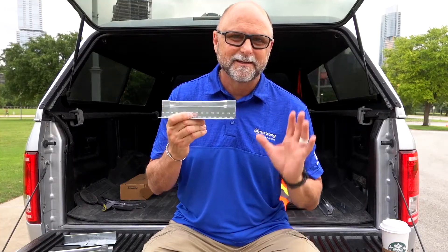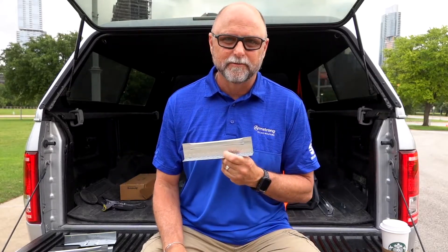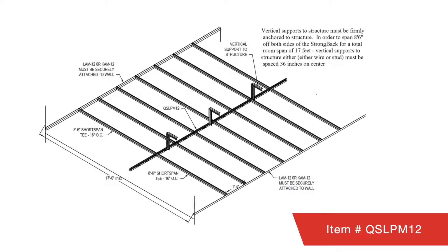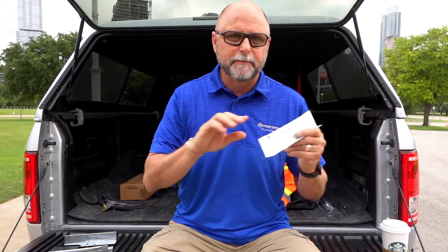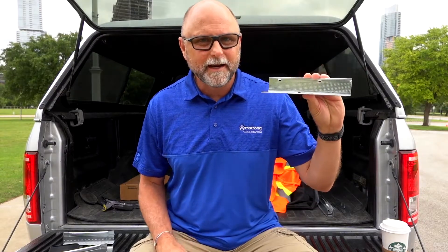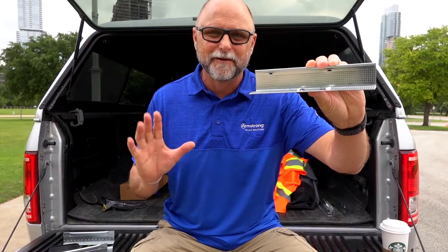What's the max that short span can span? How about a 17-foot room? Just install a locking pocket main runner down the middle of your room with four foot on-center support to structure. Then span eight foot six off either side of the main and you're done. Don't forget to use locking angle molding along both parallel walls.